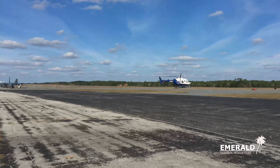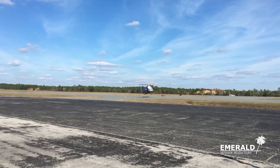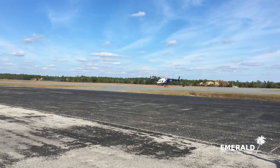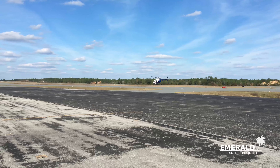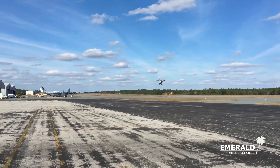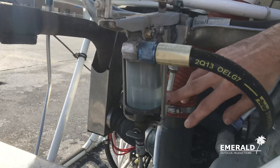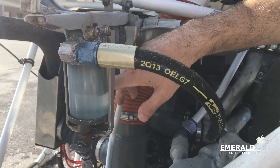Moving up to the short shaft — oil is right here. This helicopter likes to sit just above the six-quart mark. If you fill it to seven it's going to drain some out. It also has a back-flow valve so it drains back into the engine the longer it sits. For the most accurate reading, check it on post-flight, or once you get it started and warmed up.